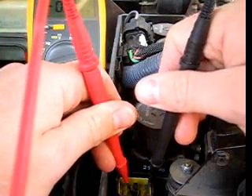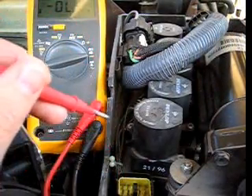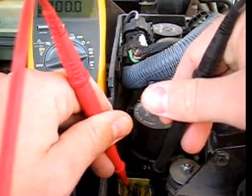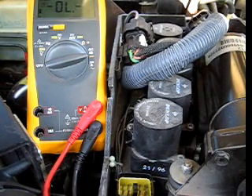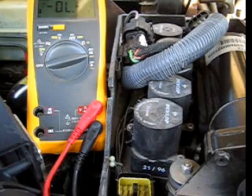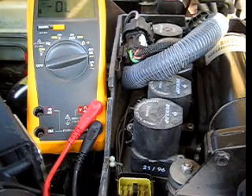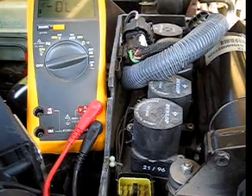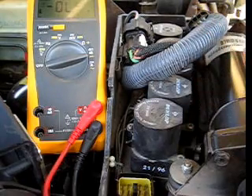Now that circuit is completely closed — no resistance at all. The state has changed from open with infinite resistance to closed with no resistance. That means our pressure switch is working properly and signaling that we're over 140 psi. So if it doesn't change state, then the pressure switch is broken, or you haven't built up enough pressure yet, or possibly your compressor isn't functioning at its optimum rate.